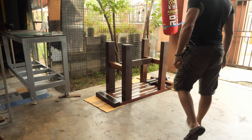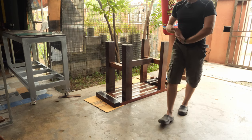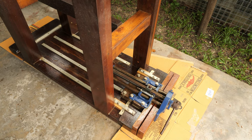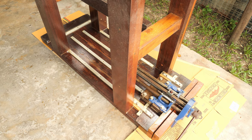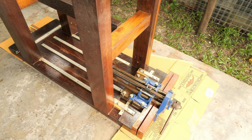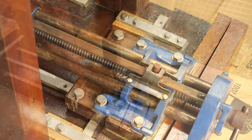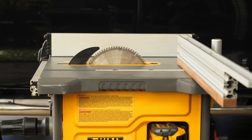This gives us the rare opportunity to see what's underneath. So this is the bottom of my workbench. As you can see, I put six-millimeter-thick aluminum bars and screwed them to the bottom of the bench to prevent warping — and it pretty much did the job; the bench is not warped at all. Here you have the heavy-duty vice, and here are the legs that I will attach the heavy-duty wheel casters to.